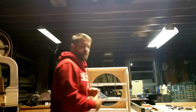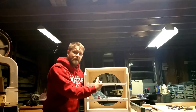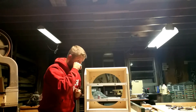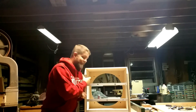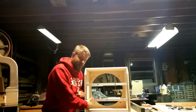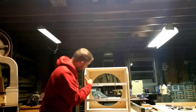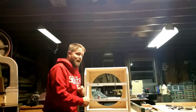Next I'll take the mirror cell — actually I won't take it to the drill press, I'll just use a regular drill — and I'm going to drill a 9/32 inch hole through the mirror cell in these three places, and then the corresponding three on the other side. Then I will come back and show you how I mark for the holes in the mirror box itself.